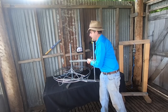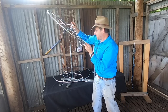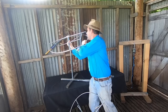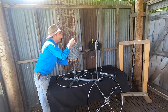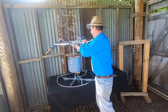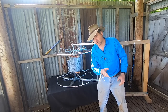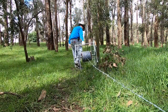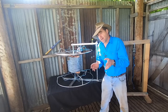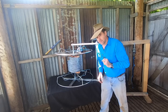Here's the simple process to turn it into a mobile barbed wire dispenser: first take the top brake bar off the spinner, take the spring off, then reverse both of your two wire wheels and put them on back to front. Put your barbed wire pack on between the two reversed wheels, then replace your top spring and top bar — you've now got a barbed wire dispensing trolley. This setup allows you to safely and easily run out your barbed wire along the ground, towing this thing behind you like a simple trolley. So if you're going to run out a lot of barbed wire and don't want to go to the expense of buying a specialized barbed wire spindle, this little spinner might be the answer.